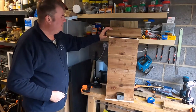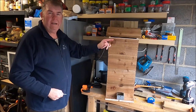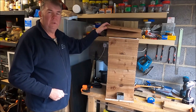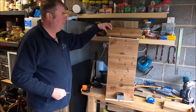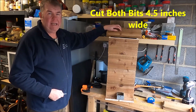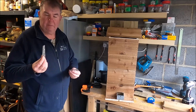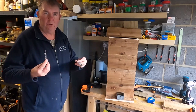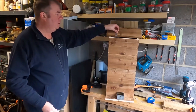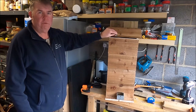For the roof, you'll see from the slope at the back that you want about nine inches of overhang at the front, but these fence boards are only six inches wide. So I'm going to cut two of these straight down in half which gives us nine inches. I'm just going to fix them together with fixing plates - you can get these anywhere: Screwfix, your local hardware shop. I'll tie two boards together like that, and then we just need to fix the roof on.